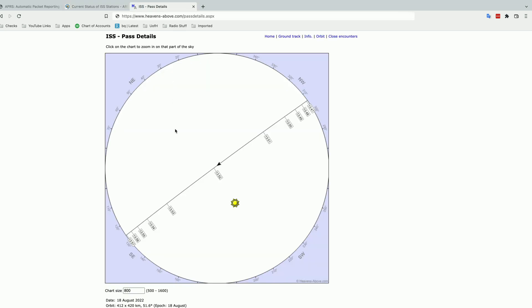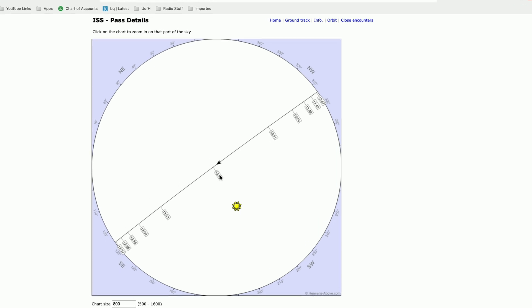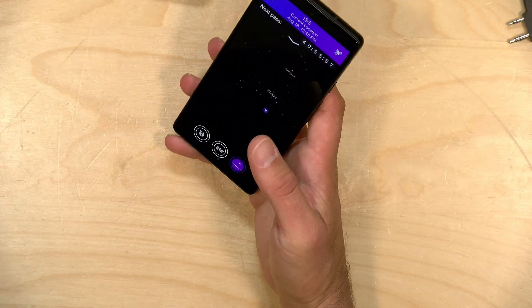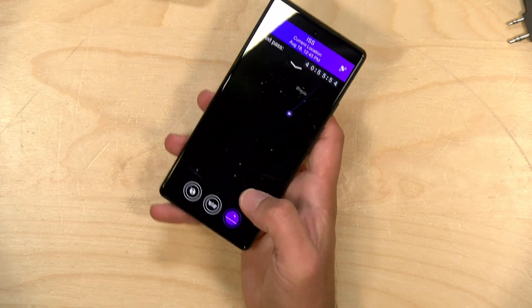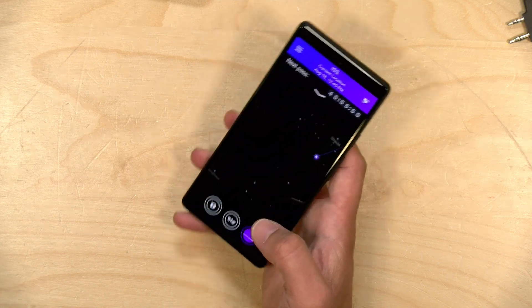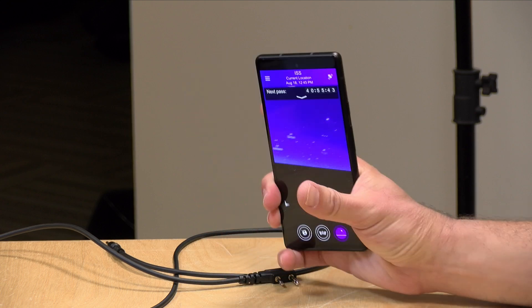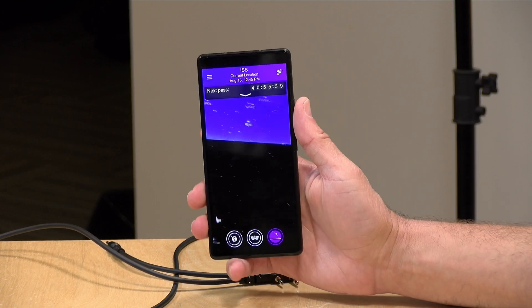In order for this to work, the space station has to be visible to you on the ground — not necessarily with your eyes, but at least with your radio. Today at 1:52 p.m., about an hour from the time I'm recording this, the space station is going to be directly overhead according to heavensabove.com, which is a great opportunity. To figure out where it is in the sky, I've got an app called Satellite Tracker. Right now I've got it pointed toward the ground because the station is on the other side of the earth, but as the station orbits overhead I can angle it up to see exactly where it is and get the antenna pointed in the right direction.